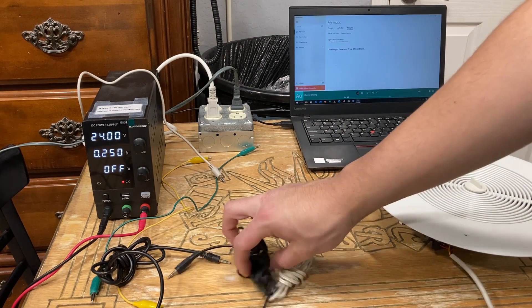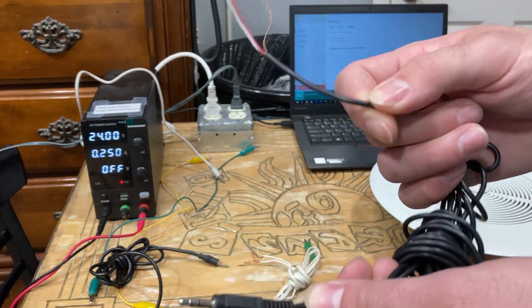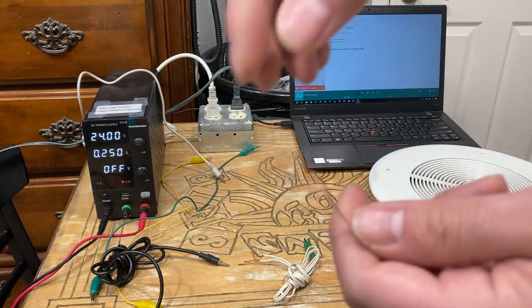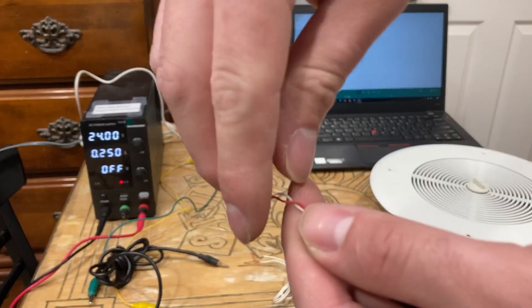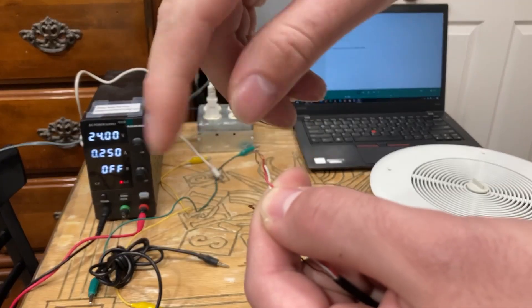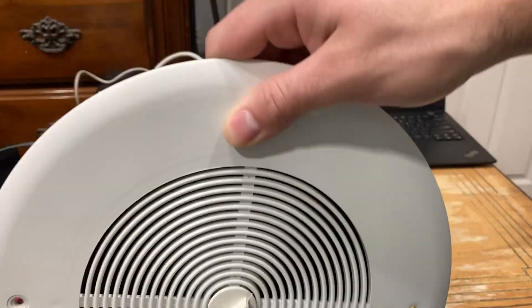Let's go over our audio cables, such as these 3.5mm cables I'll be using for this application. Usually you'll have a male-to-male 3.5mm cable. You chop off one end and you should be greeted with these wires here. You have a bare copper and left and right channels — your stereo channels. You want to take the red and the white and twist them together, because you want both stereo channels combined. This is a mono device.